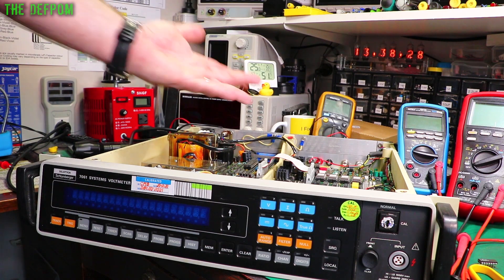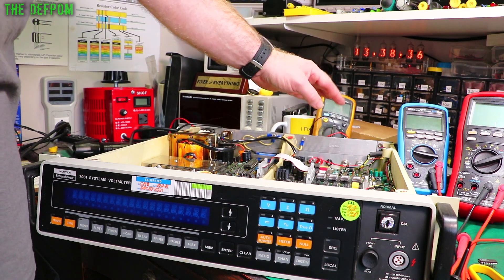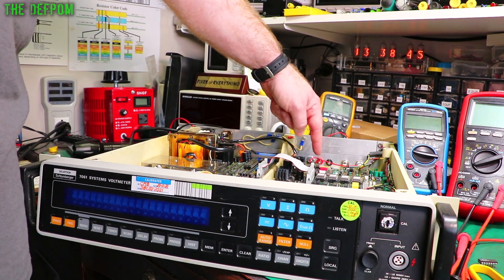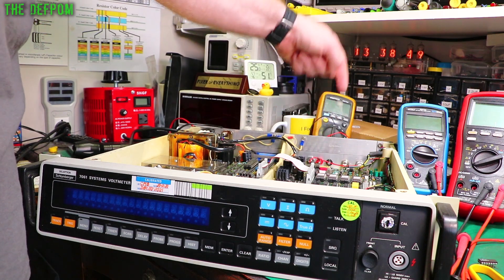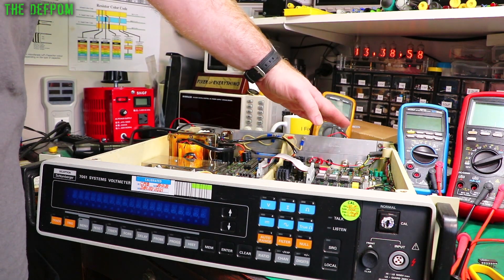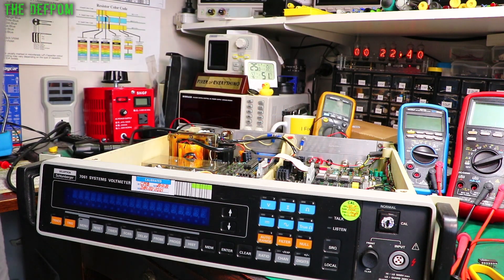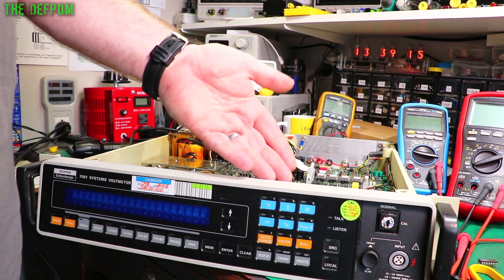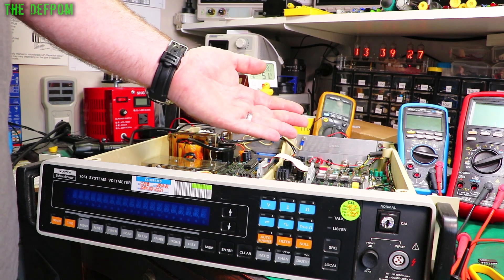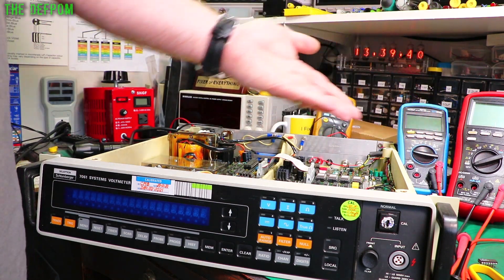Running out of options. Here's what I've done: I've fixed up that burnt mark — it had actually burnt through the board, leaving carbon there shorting between those two diodes. The diodes seem intact so I'm leaving them alone. I scraped the carbon out; there's now a hole through the board where the carbon was, because you can't leave it there as it'll start shorting again and get worse. The only thing that's changed since I got this three months ago is I changed the integrator IC to the LTC1052. I got those from DigiKey so they should be genuine parts, but it ran fine for a day and then blew up this morning.